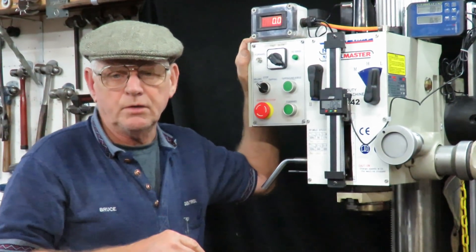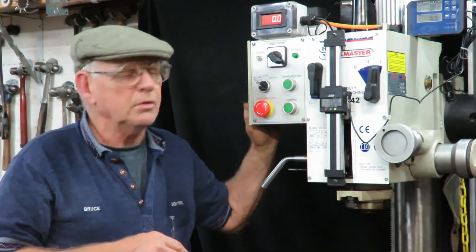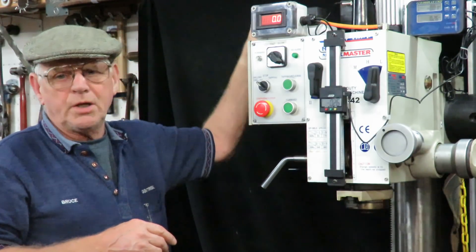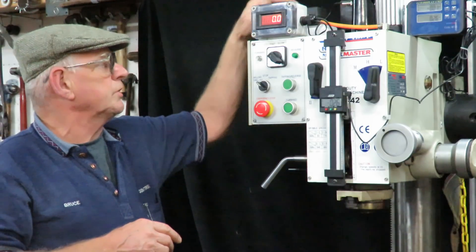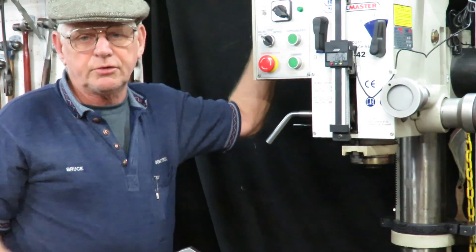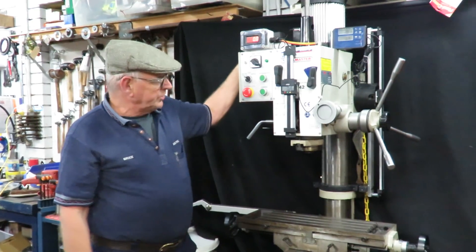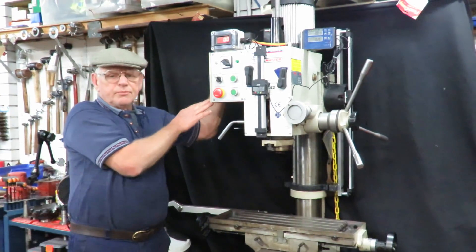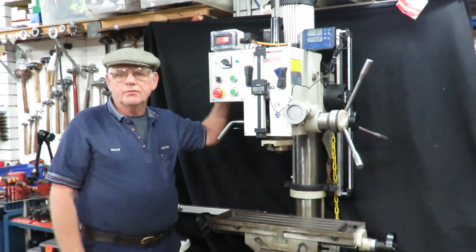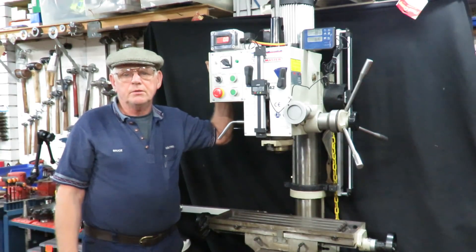This machine is three phase 415 volt. We changed that to three phase 415 with a neutral added, and set up a single phase supply — because here in Australia we run 240 volt single phase and 415 three phase. We put a double socket at the top, which gives us power for the readouts and other things and the lamp on the machine. I've done that on all my machines — those that are only four wire, I've changed to five wire: three core plus earth and a neutral. The reason is I don't like power coming from two sources to one machine. If we turn off the power to the machine, it turns everything off, avoiding the potential danger of having power from two sources.